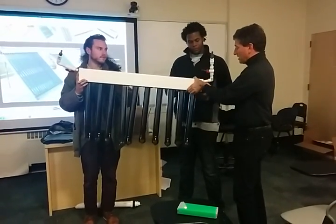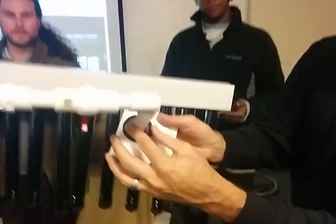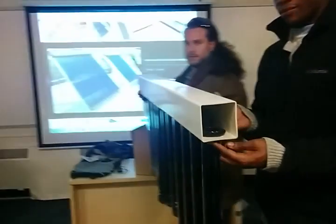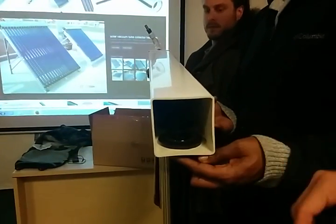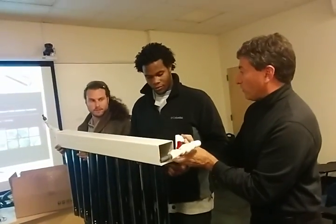We have this fence post with these caps, which have this beveled kind of look to them — just the right size for a half-inch uniseal, which is what we're putting in here. We've got our pipes with our valves, half-inch. If you look over on this side and open it up, you'll see we've taken these vacuum tubes. For $100, we get 10 in a box from an electric bike company on the West Coast — $10 a tube when you buy the full box. We've got these two-inch uniseals from U.S. Plastics or AussieGlobe.com, and it just so happens the two-inch uniseal is exactly the right size for the vacuum tubes. We shove them in until they come just above the top of the rubber in the uniseal, and we're able to fit all 10 in a standard fence post — almost as if it was designed for that.